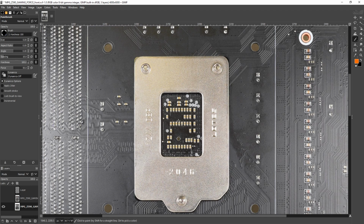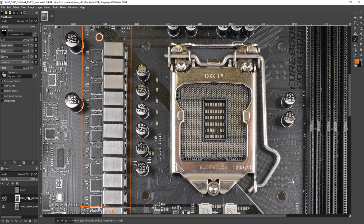But yeah, in terms of voltage regulation, this VRM configuration that MSI has looks very normal. It doesn't look like they're doing anything very special, but it works really, really well. From testing, there's no issues with this. It doesn't look impressive. There's not, oh, they're putting tantalums in interesting places or using super low ESR, low ESL capacitors. On paper, I'm surprised that this works way better than it looks, is one way to put it. But the important thing is that it works really well, right?